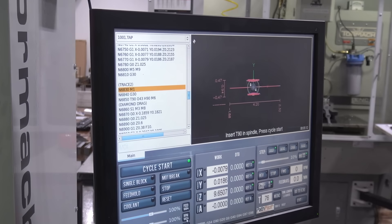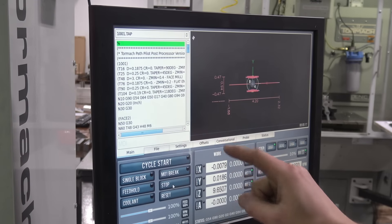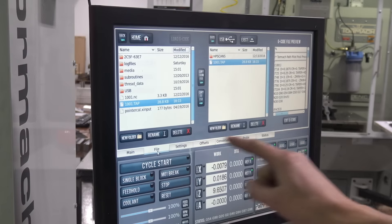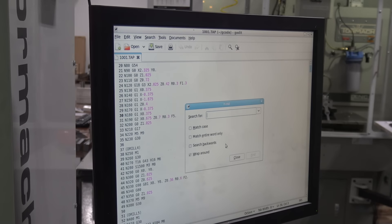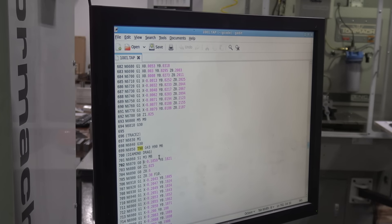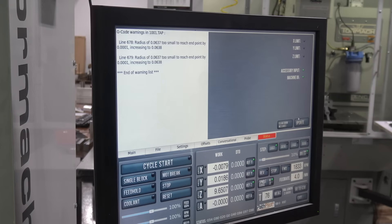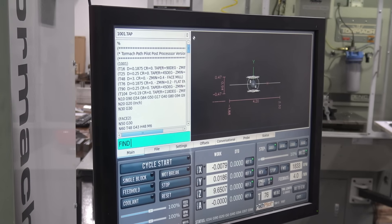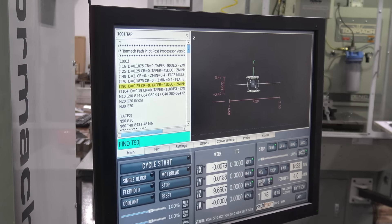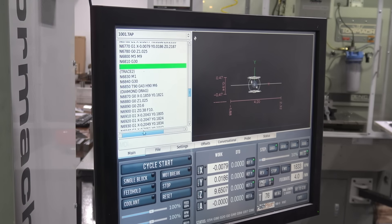It's engraved. You're supposed to turn the spindle off for this. Right now, Fusion can't do that, so I have an S1 which will give me an error but still run the program. So let's hit stop, edit our G-code file. I can hit Control-F to find T90. I need to delete this line here — select it, delete it, hit save. Now the problem is I need to scroll all the way down. Find T90 — next one. Now I can right-click above it, set start line, boom.